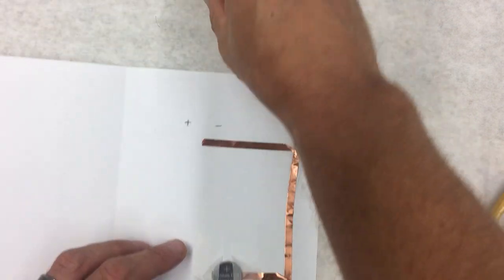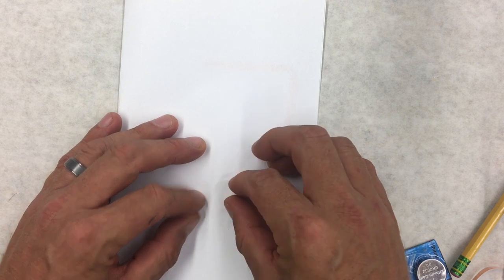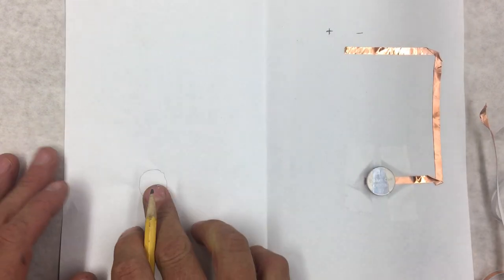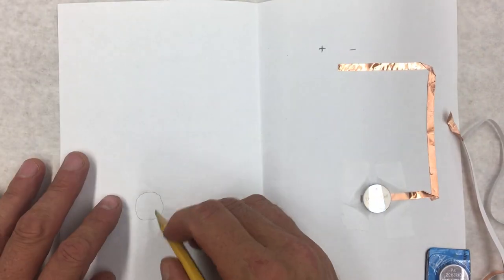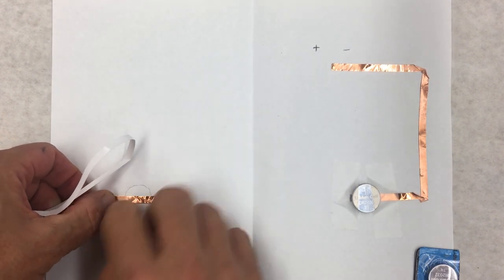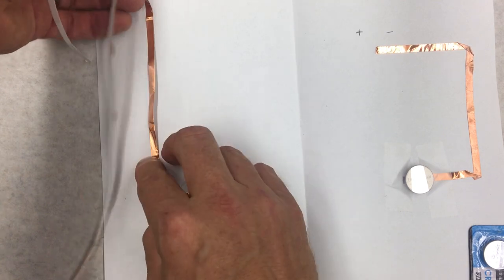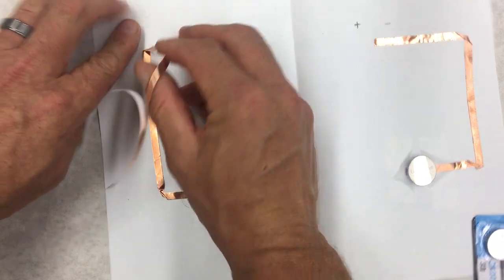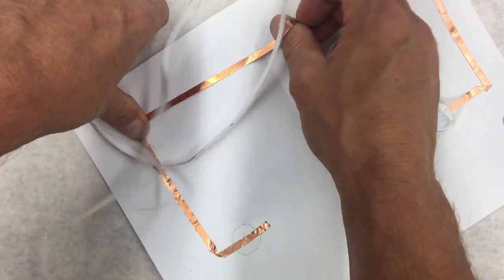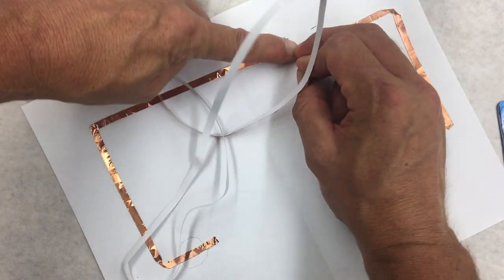All right. I'm going to put my LED to the side for a sec. Now I'm going to close this carefully on the fold, and I'm going to press down around where the battery is. What that's going to do is mark the left side here to show me where the battery touches, because here is our switch. Closing this creates a switch, so we need to put the copper tape that remains from here going through the middle of that, making sure it can touch. Turn the corner, and we're gonna go back across. This is gonna have to go across the middle ground here and back to where our LED is, to the positive part. We do not want these halves to touch. There should be a gap there. So get a little lower and that's pretty good, right about there, okay?